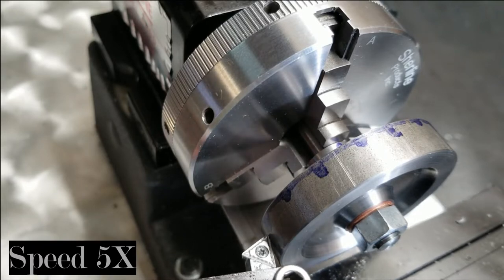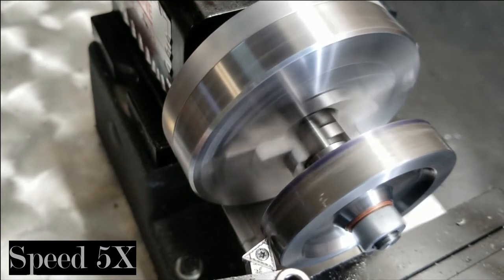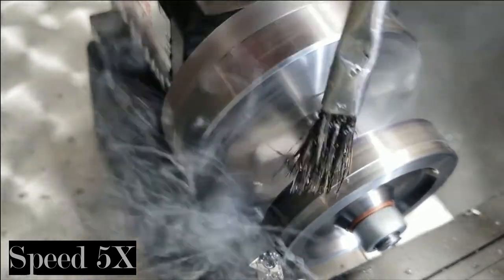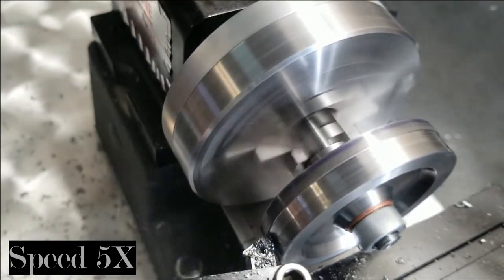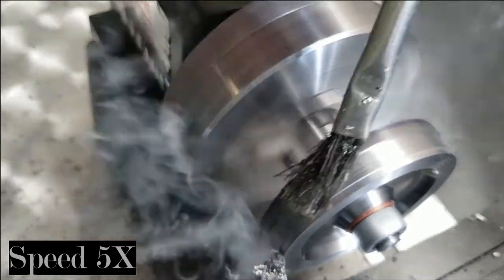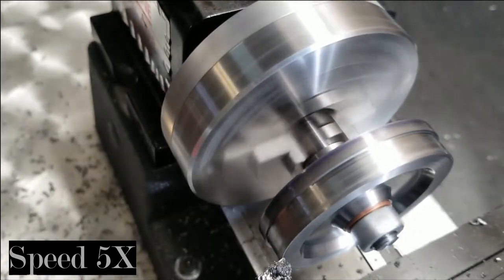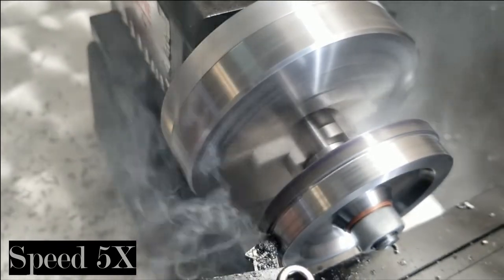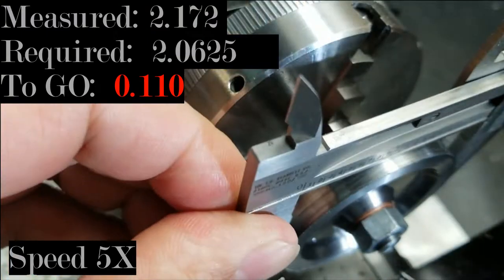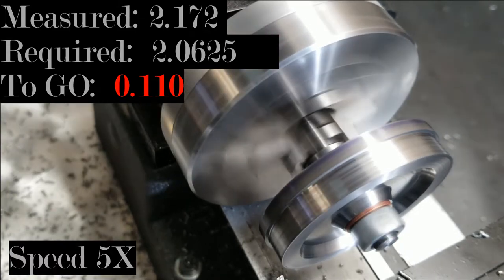I want to point out this fantastic round flat wrench — it's just absolutely dead flat and has been great for cinching up the tender wheels against the arbor base and getting them running true. I don't want to over-tighten because I've made mistakes that cause the arbor to turn, which requires remachining it down. I'm going to take a real light skim cut to index — just going in about 10 thousandths first. My rough measure shows I've got 110 thousandths left, so that's good.